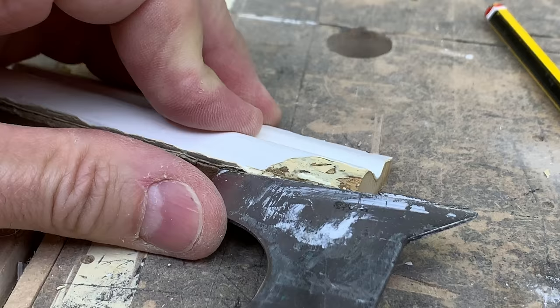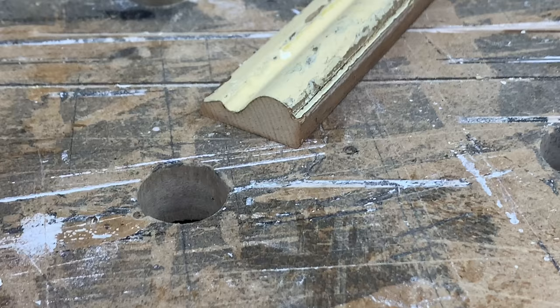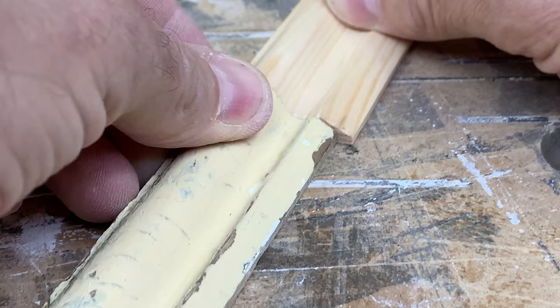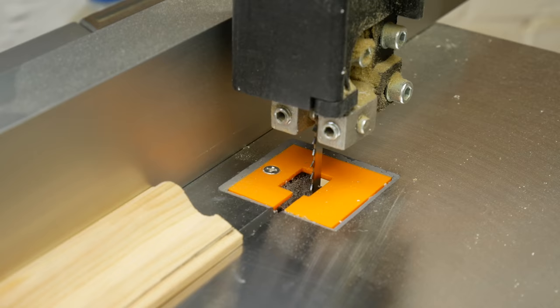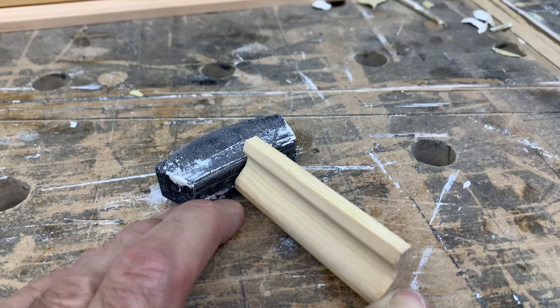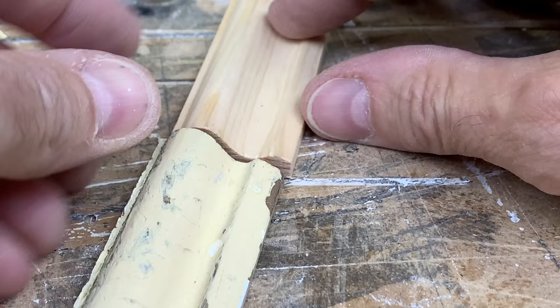But it's for a client that I've known for a long time. Long story short, they've had some work done in their house and they've got a couple of little bits of moulding that they want replacing. So what I've got is some OG panel moulding and the shape matches pretty well, but it is tall so I've just got to run that through — I'll do this on the bandsaw probably. Hard to make that cut on the circular saw, just having the blade peeking up a little bit and it's hard to guard the blade. So I'll just run that through on the bandsaw, it's only a few mil. I'll cut it slightly wide and then just trim that back with a hand plane. With a little practice bit of moulding trimmed back on the bandsaw and then planed down, that's a pretty good match, that's a pretty good fit. I think I'm happy enough with that to know what I'm doing now.